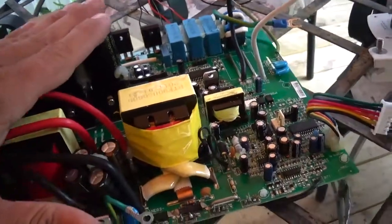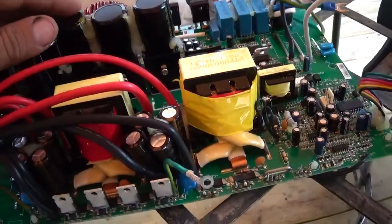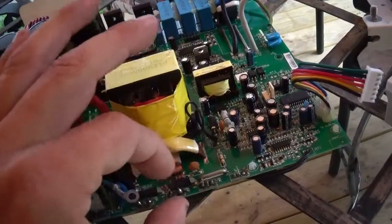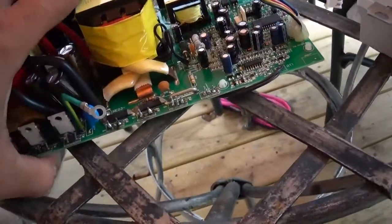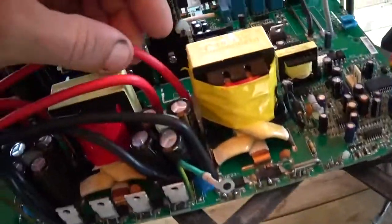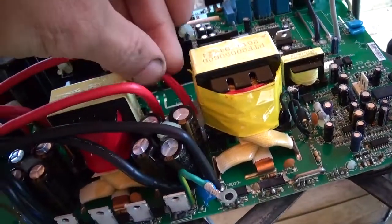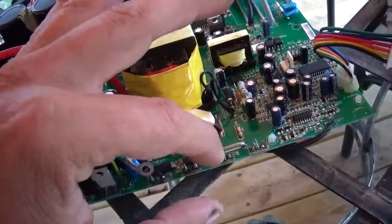The solder on the board is definitely California compliant. I mean, I got a 60 watt iron, and I could not get stuff desoldered with it. And that solder iron is a pretty good one. I've put it on giant terminals, like these wires here. They usually got a massive amount of solder on the other side, and of course you got to heat up that wire before the solder melts, and that iron usually does the job. I couldn't even get these legs out of this thing.